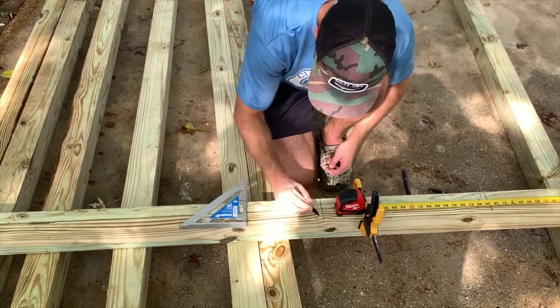I then installed some decorative lights on the front of the shed the exact same way that I installed the lights on the side. I then routed the electrical cable from those lights to the incoming power supply with the exterior switches. I wired two light switches on the shed's exterior. One light switch controls the two exterior lights on the sides of the shed, and the other switch controls the decorative lights on the front of the shed.